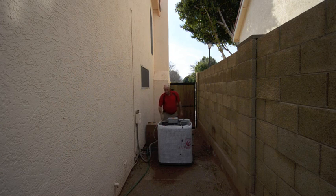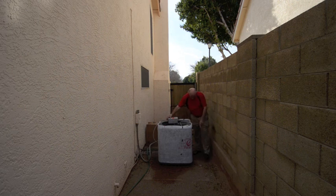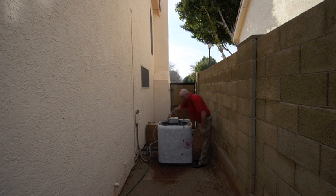I've now turned the water on, and what you need to do to test is if you just lift the flapper with your finger just inside the end here, and that you check around and make sure that you've got no leaks and that you've got the misting system working correctly. You're all ready to fire up your AC and enjoy the effects of the Flashvap cooling system.